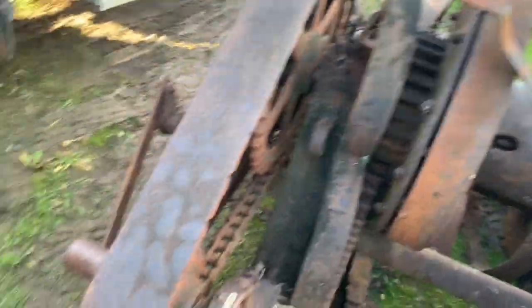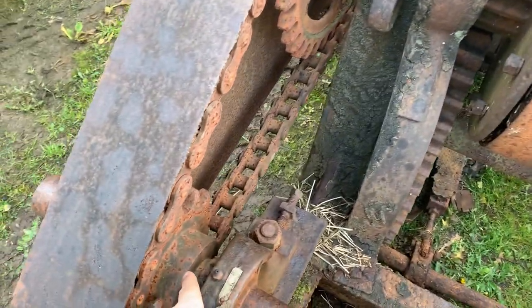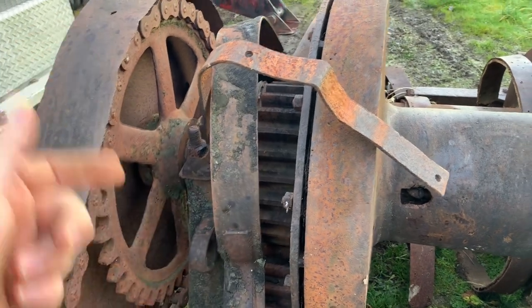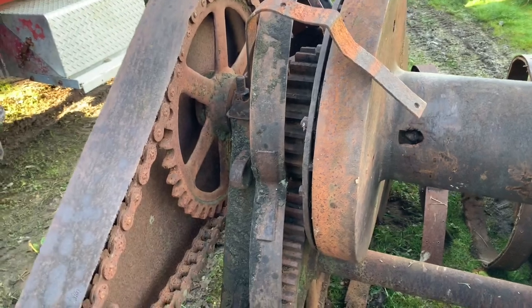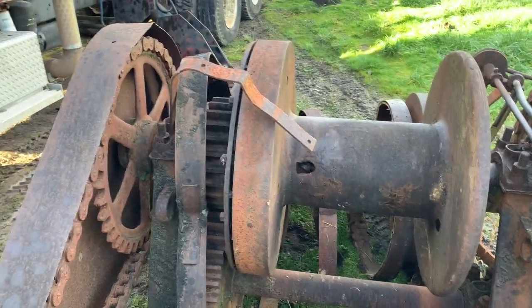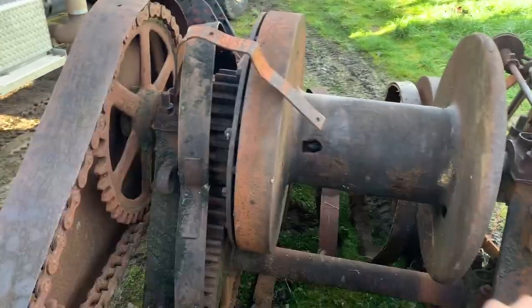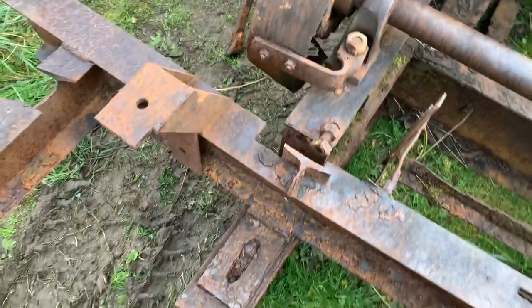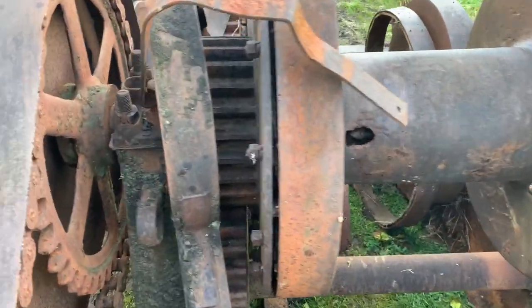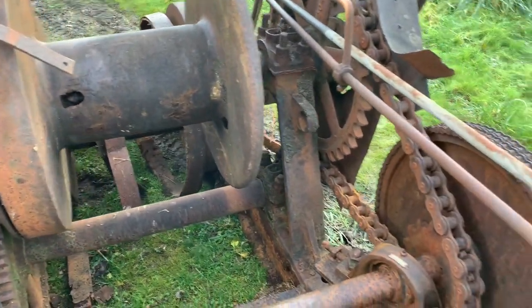From what I can tell, it looks like this was definitely an addition — someone stuck a motor on here. But these sprockets here, these small ones, went on each end. And then the big ones actually went on to the Fordson tractor and would drive it. Because the Fordson tractor is geared so low, that way it would get your line speed up. It looks like someone reversed these when they made it. The reason why there's a chain on both sides is because tractors are open differential, so you need to have both sides powered to make sure it has power all the time. It had like a saddle of some sort that the tractor bolted onto and set up back here. It's made for a gypo — you take your tractor and bolt it on and start logging.